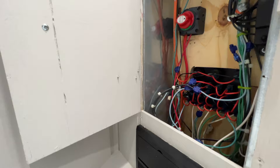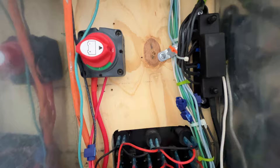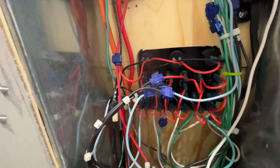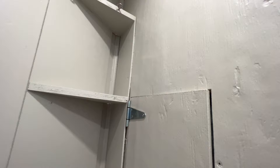Just one more thing in the bathroom — this is where I have all my connections. I have a battery shut-off. This is the back of my power panel, and that's all my negative wires connecting in there. My positive wires go to the switches and the back of the panel. I left it open like this so I could have easy access if I ever need to add or fix something.